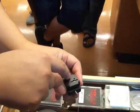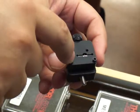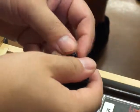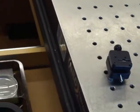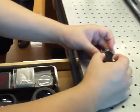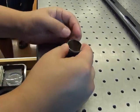What you do here is you put the mirror right here. These are the two little screws and they act as anchors. If you loosen this one here, you put the mirror in and then you tighten it up. I'll pull out the mirror and put it in. These are front-side mirrors, which means you're not supposed to touch them and they're very hard to clean if you put your fingerprint on them. Just put it here with the two screws holding two different ends and you can tighten.